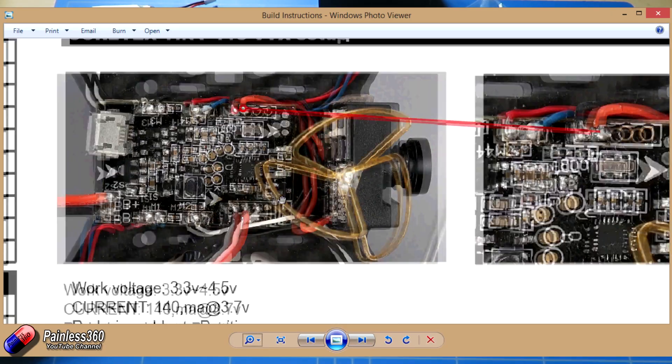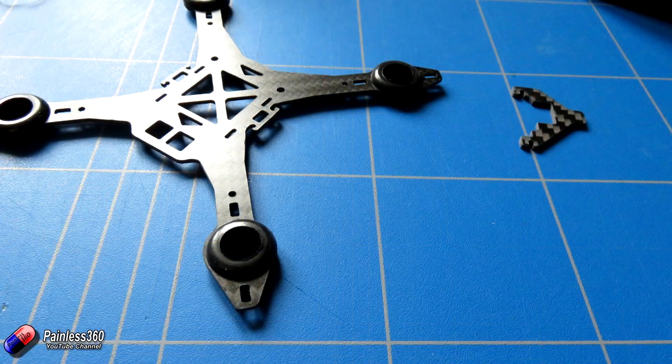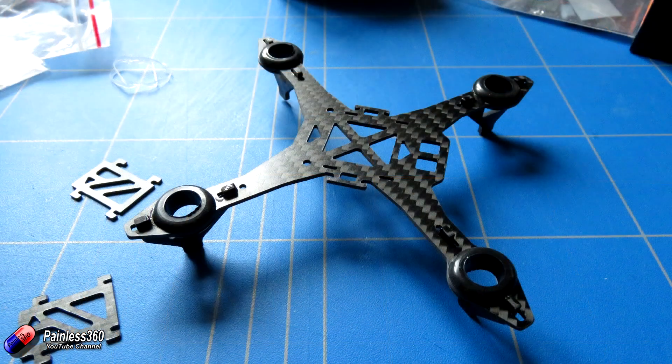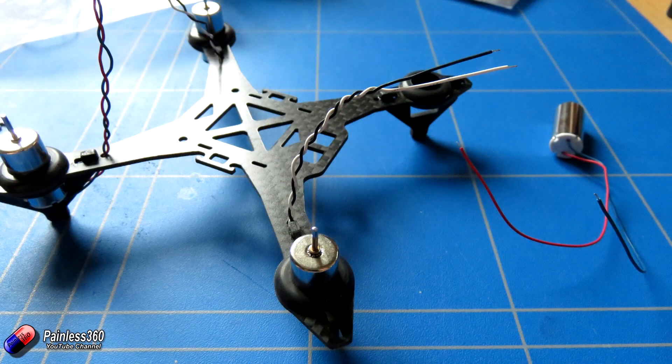The first step as we look at the manual is to wire up the motors and power to the board itself, then pop the board onto the frame. So we installed the grommets into the ends of the arms and put the little feet underneath. Once slid home, a little dab of super glue keeps them in place. Then we pushed the motors home - you can see they fit quite nicely - and routed the cables so they'd go into the central position.